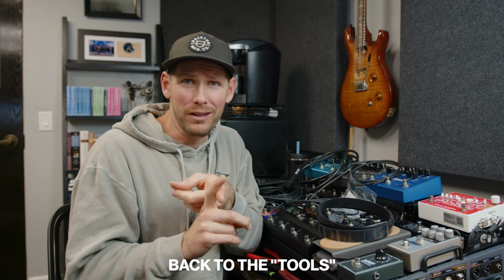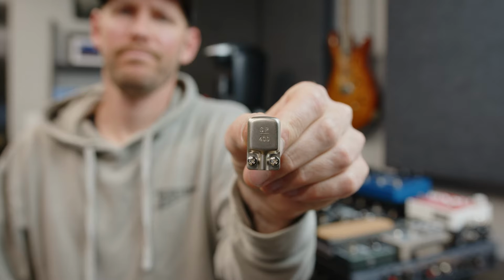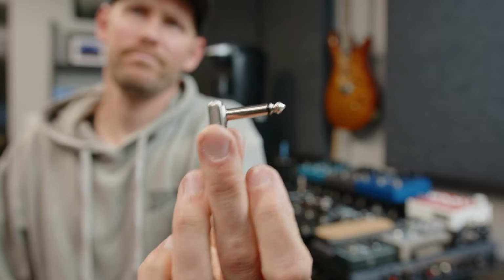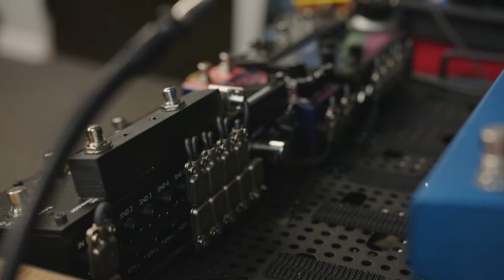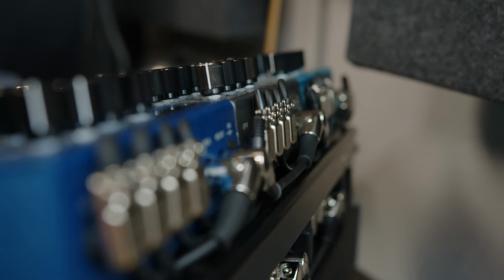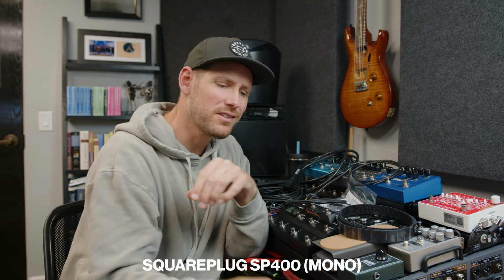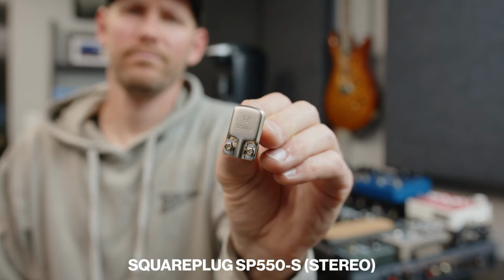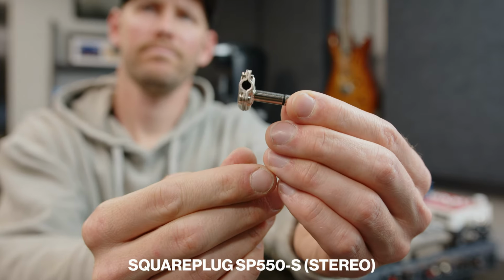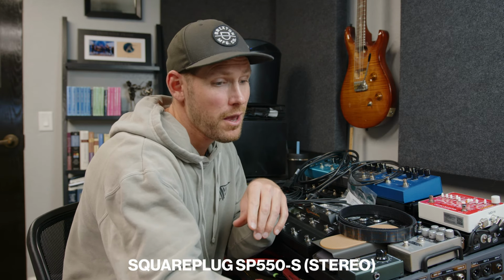So let's talk about the plugs that I like the most. I love Squareplug. These plugs are fantastic, especially because of the PVC-6X, and the board is so tight and compact. These are the smallest, and they're so easy to solder. Absolutely love them. So for all of my mono input jacks and output jacks, the SP400 is my go-to, and for the stereo stuff I go with the SP550S. And again, I'm going to show you some more of how to actually solder these in the next video, but just know for now that these are my favorite plugs by far.